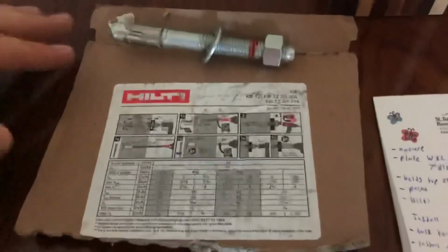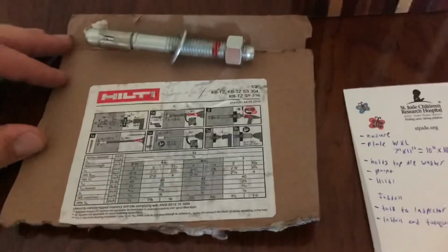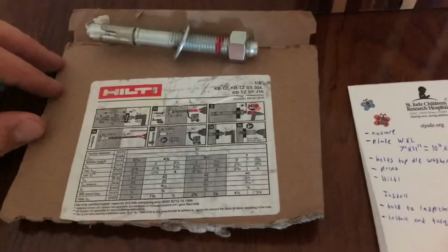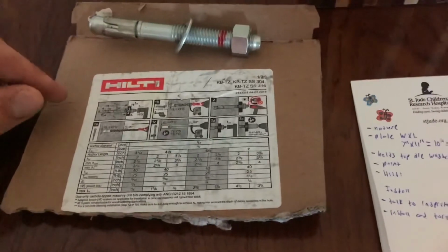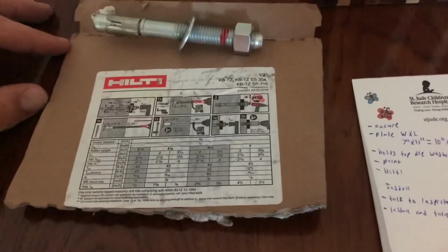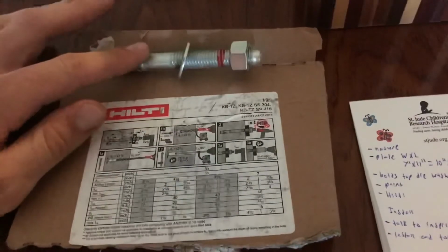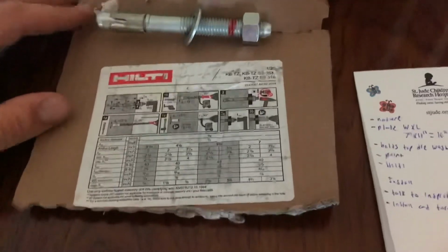Okay, let's talk install. The most important thing is you're going to want to talk to your inspector. They all have different rules and how they like to handle it. Most times with this install, the inspector will be okay with you tap and dyeing, drilling holes in the concrete and laying out per your base plate. The one thing they will need to see is they're going to check the depth of your Hilti. They're going to torque test it and make sure the holes are clean and that we did not hit rebar.